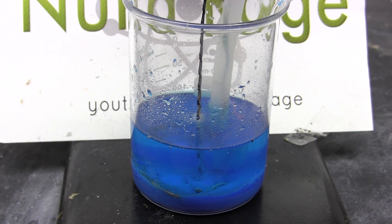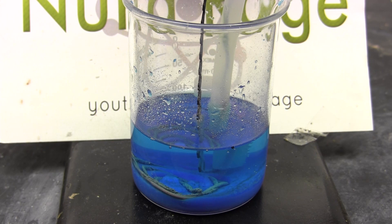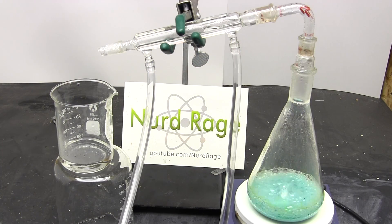This will take a very long time, so be patient. What we're doing here is plating out the copper ions onto the cathode to get copper metal. At the anode we're electrolyzing water to get oxygen. The sulfate remains in solution and we get sulfuric acid — we're essentially recovering the copper metal and sulfuric acid in this step. The undissolved copper sulfate will dissolve as the concentration in solution decreases from the copper metal plating, which is why we didn't need to completely dissolve it before we started. We're using a platinum anode as it's one of the few that can withstand this electrolysis; you can also use a lead dioxide anode. We couldn't electrolyze the copper chloride directly because the anode would release chlorine gas and waste the hydrochloric acid — not to mention chlorine is toxic. That's why we went through the trouble of converting it to copper sulfate.